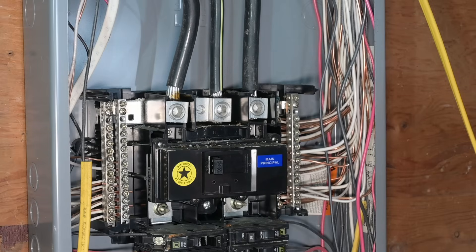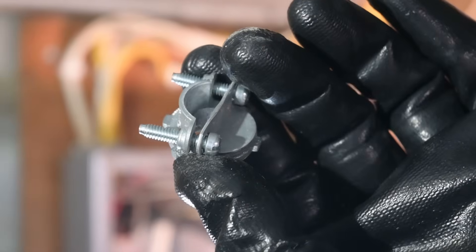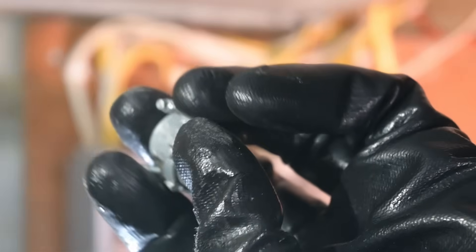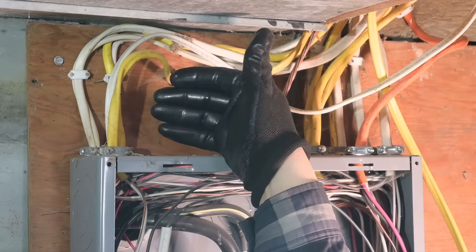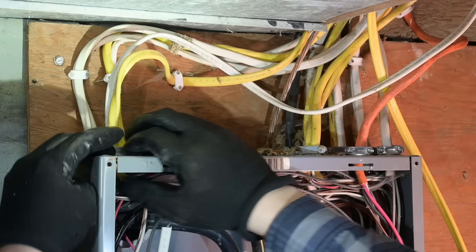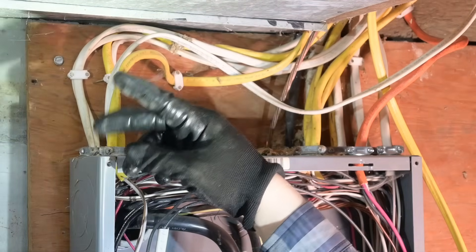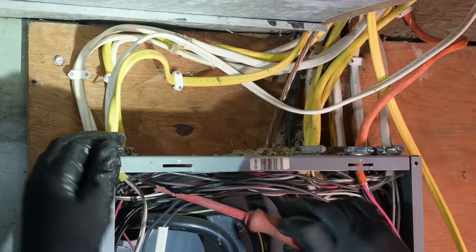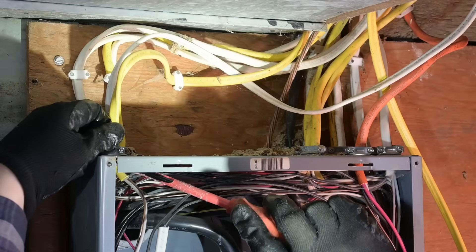We're going to open one single half-inch knockout in the top corner of the panel. With a standard cable clamp like this, you can actually bring up to two cable assemblies through it — two 12-gauge cables or two 14-gauge pieces of Romex. If you have cables going through that aren't already paired, you could add through an existing knockout. In our case, we're opening a new knockout. I just bent that little knockout out, then dropped in our cable clamp. Use a screwdriver to reach in and push the lock nut tighter, and needle-nose pliers to get it snug.